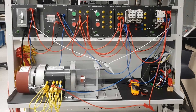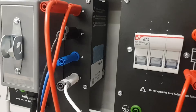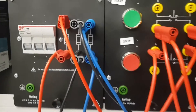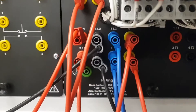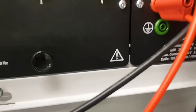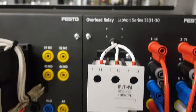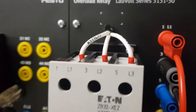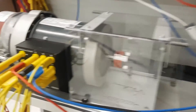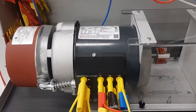This is the connection diagram for both the control circuit and the power circuit. In the power circuit we start with L1, L2, and L3, which go to the fuses for short-circuit protection. The output of the fuses goes to the contactor — we have L1, L2, L3 in and T1, T2, T3 out. The output of the contactor goes to the overload relay, with L1, L2, L3 as input and the output going to the motor — the red, black, and blue phases.